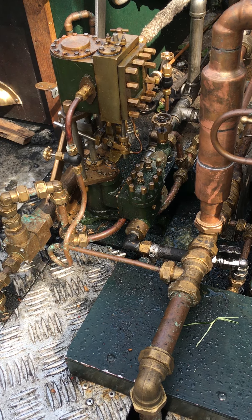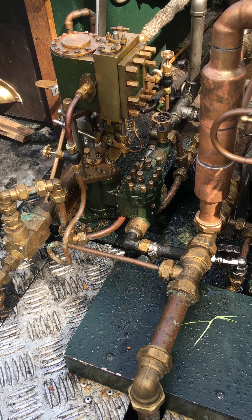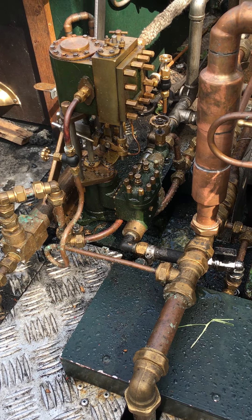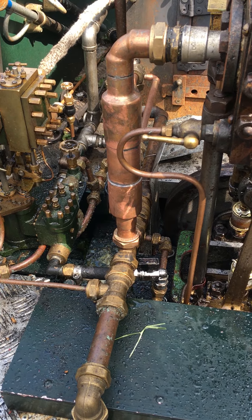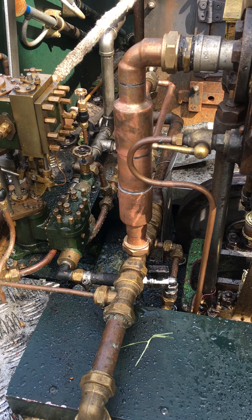Recent modifications test to steam launch Isambard, the 12-inch vertical steam pump. I've added a displacement lubricator and also a drain cock to the steam chest. In addition to that, we've also built a heat exchanger on the exhaust system so that I can feed heated water to the boiler.